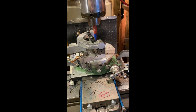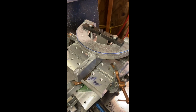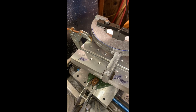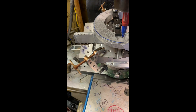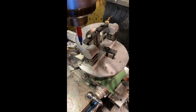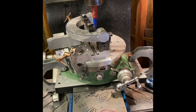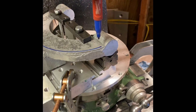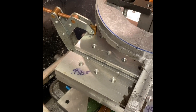I mentioned that there were no dimensions, so I had to figure out how to cut the outside of this frame on the rotary table. Basically I set it by eye — I knew the center of my rotary table, and then I kept adjusting and adjusting. You can see I put a felt marker in the quill to check and make sure that I was on the frame correctly. You can also see I had to move my mounts to the inside of the frame to hold it on the pallet.